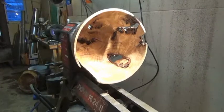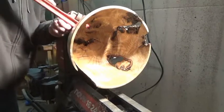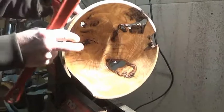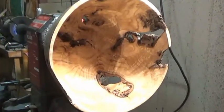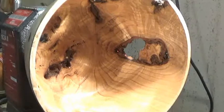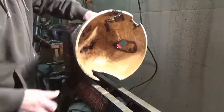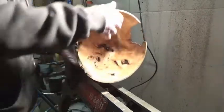So I'm gonna pop this thing off here. Spin it around a little bit. There we go. There's a little notch. And I like to pop it loose, because if you just torque on it, I'm afraid I'm going to break my indexing pin or break the bowl. Yeah, I'm like an idiot. I didn't loosen the Allen screw. Hold on. There's a little Allen screw that stops this thing from backing itself out when you're running reverse. And if you don't back that out, it won't unscrew either. And if you force it, you can actually mess up the threads. There we go.